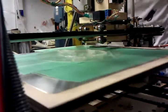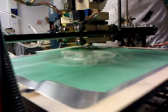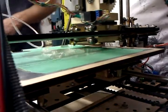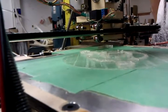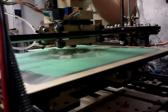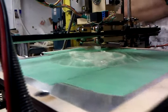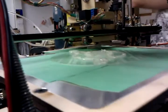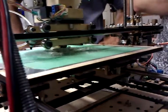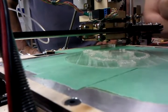I think it's already a success. Tuning this thing is sort of a fiddle-with-it-until-it-works process — there's no real linear procedure that gets you to the right setting. I eventually figured out that if you take the motor off and just try manually feeding, you can see how it's melting and feel how much force it requires. Then you put the motor on and adjust the motor current until it feeds reasonably reliably.